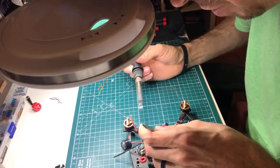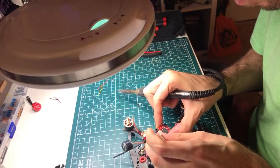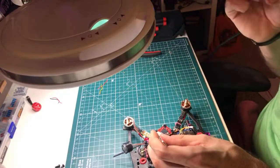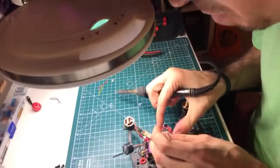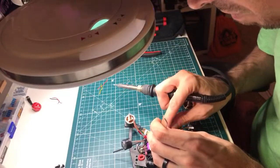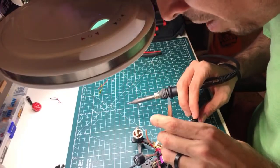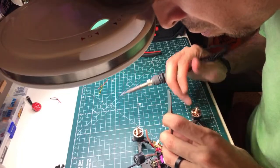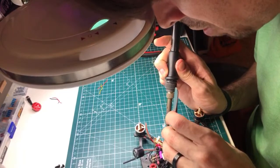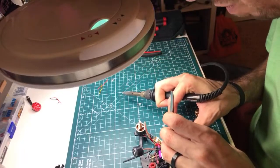The reason I do this is when a wire is going to have to run between the flight controller and the ESC, I really like to get it as tight but loose, to use Steel talk. Not so tight that I'm worried about it tearing off and breaking, but not so loose that there's much of a chance of it banging up into the flight controller, or even worse, vibrating against the flight controller with the inherent oscillations of our flying vibrators.